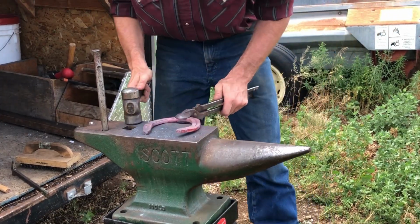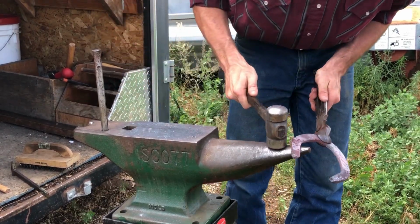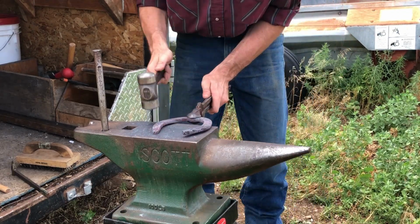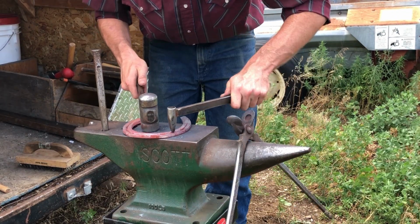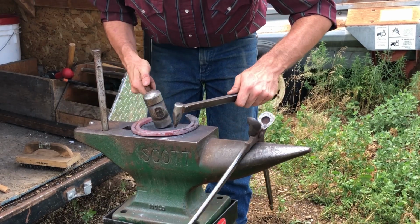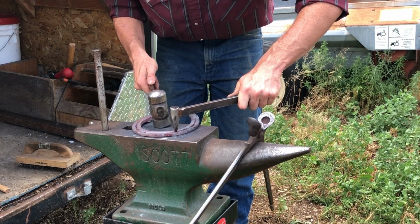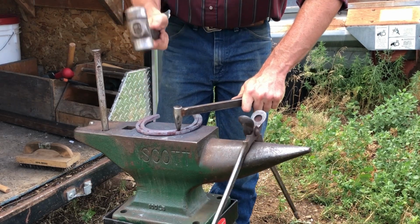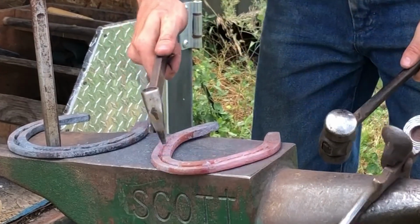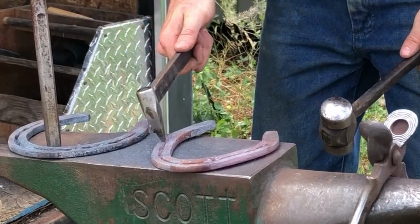If I drive my punch too deep, I'll create what's called frog eyes in the stock, and it'll expand outward in a circular form. So to prevent this, I try to make a certain number of concise, level hits in every single hole. So for me, I'll make 3 heavy delivered hits in every single hole, and if I need to, I can go back and hit each one another time if that doesn't take it quite deep enough. And that way, I don't overstep and drive my holes too deep with my punch.